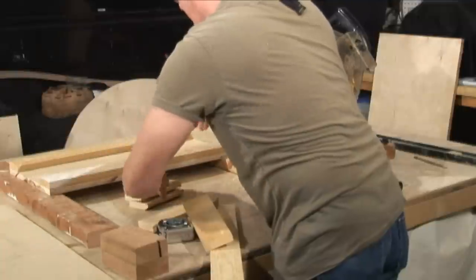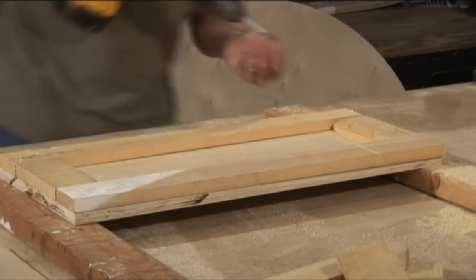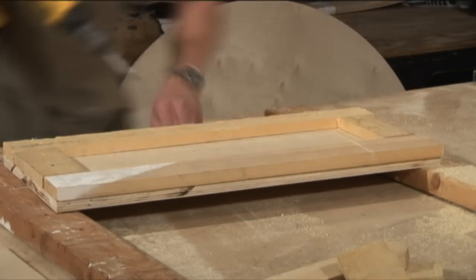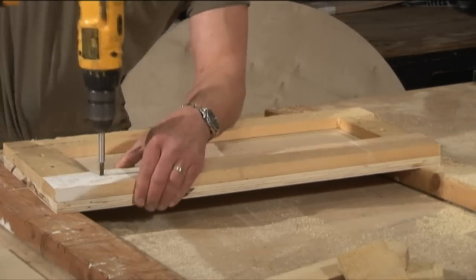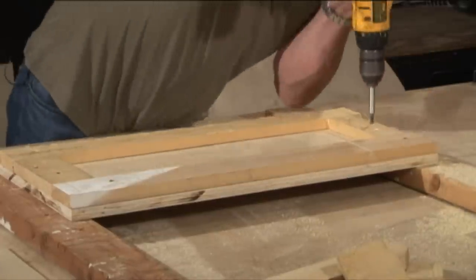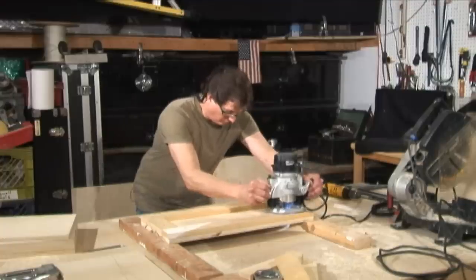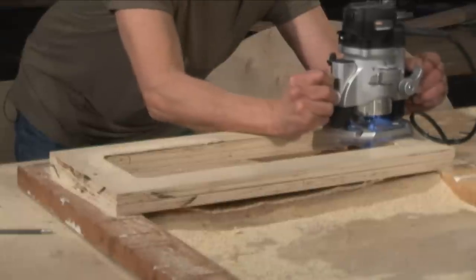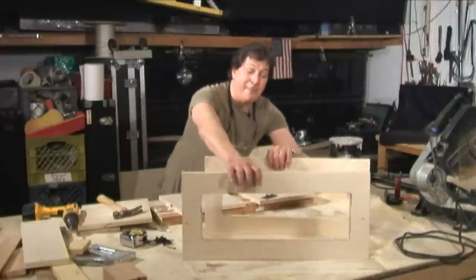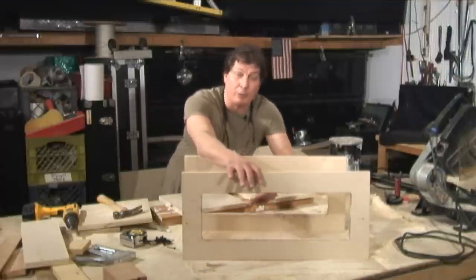Now let's focus on the front and back panel of our base. We're going to go ahead and wrap the perimeter of one of the pieces with one-by-three — that'll give us a guide to go by with our above-bearing router bit to route out the inside for an access panel. Screw your piece down nice and secure, grab your plunge router, and get ready to do a clockwise cut. Use that piece as a template for the other panel. Now we have the front and back of our base with access panels for wiring or whatever we choose to do in the future.